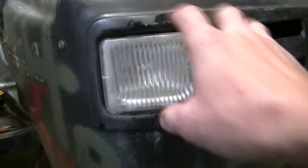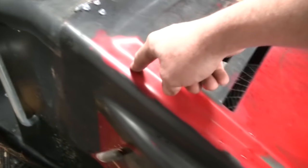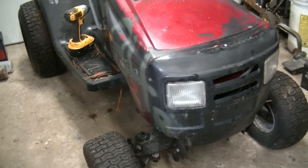I'm going to do something a little bit different and I'll get to that next. One other thing to mention: for those of you running headlights in one of these Murray grills or any tractor grill when you do it this way, you're going to have to reroute the wiring for the headlights because now the hood lifts way up. From the inside, take the wiring back to about the hinge and then tape, glue, or pin it along the inside of the hood at the top to the headlights, so you're not stretching wires. Now, since I can't quite leave well enough alone, I'm going to take this to the next level.